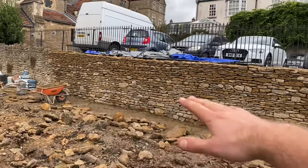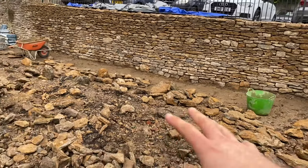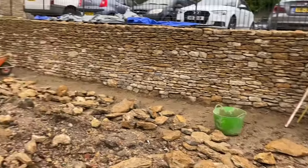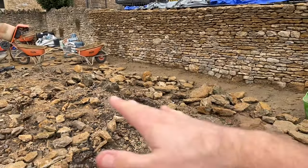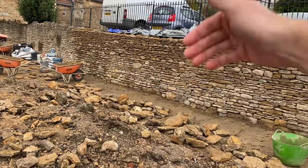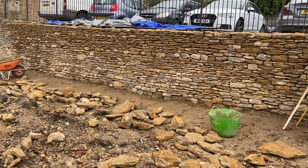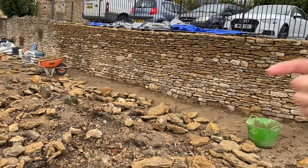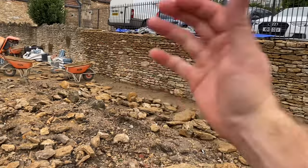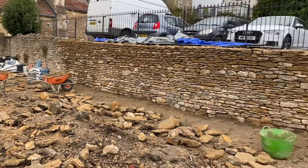Got the back done, got it basically flat, because it is quite a wide wall, and the tops we've got, Zach and Sam and this wall, are to the front of the wall, so there's going to be a bit of a back, so we'll evaluate what to do with the back. What I'll probably do is get the mortar flat and flaunch it down underneath the membrane up there, and that'll help with any surface water, because that membrane looks more like a DPC. Yesterday when it was raining, all the water was just coming off it. It's not permeable, you know what I mean? So we'll try and lip that over it, like a bit of a gutter, because it's going downhill. That'll help as well.